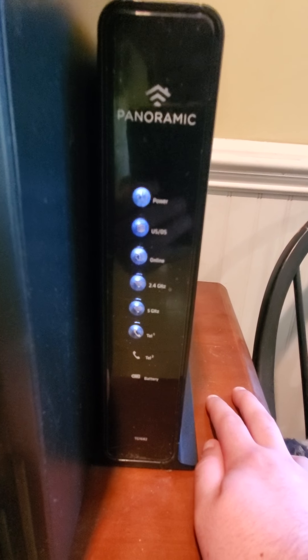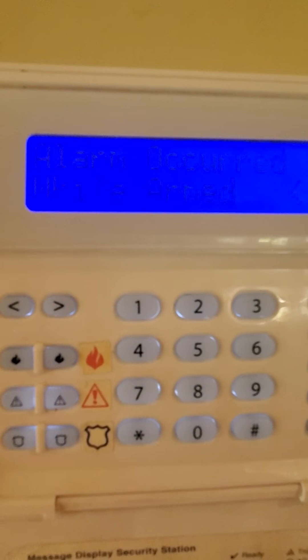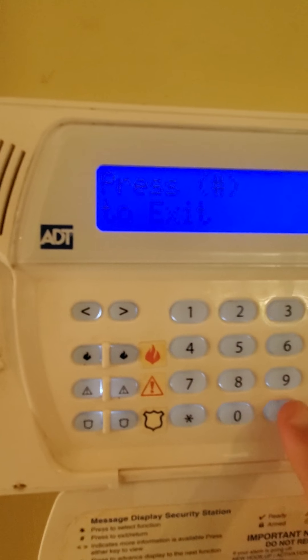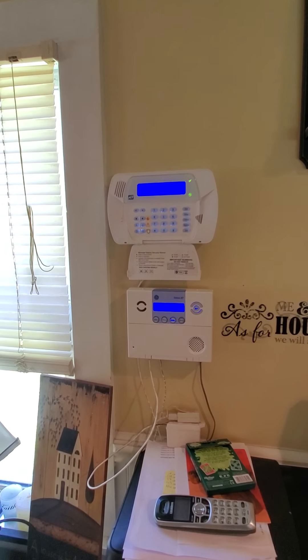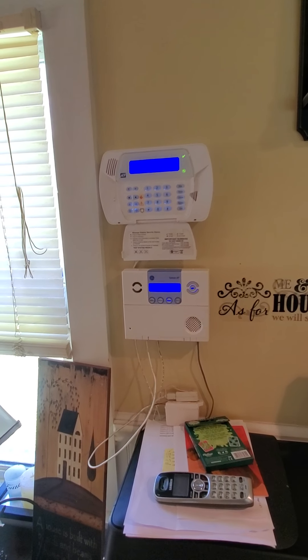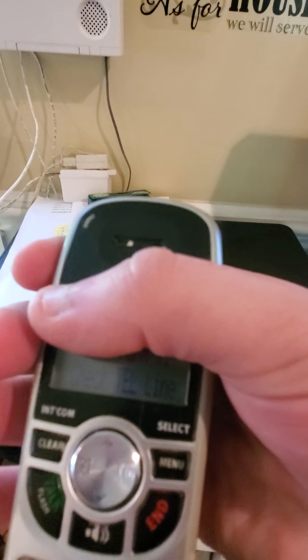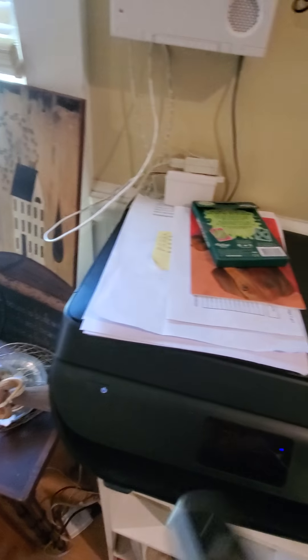Obviously it's fine — it's on test mode, it's going to shut off. Alarm occurred while armed. Scroll: zone 11, bathroom window. Pound to exit. It should be beeping to confirm communication here in a moment. There we go. Let that finish resetting. One way you can tell is it'll say 'check telephone line.' Let it go — you just heard it click.